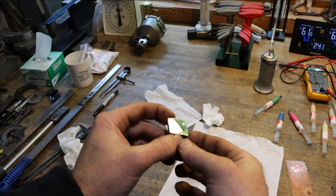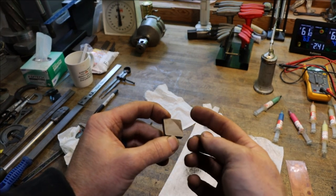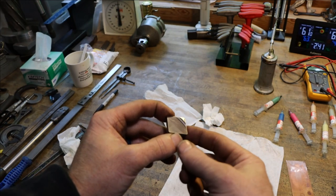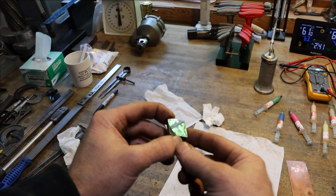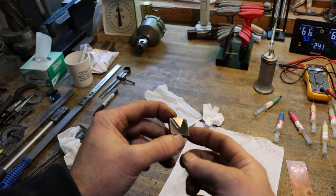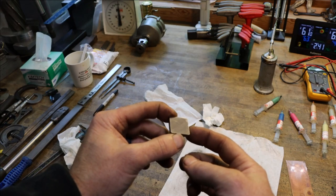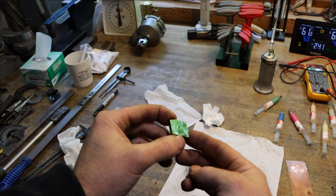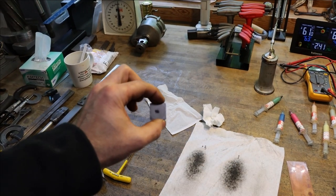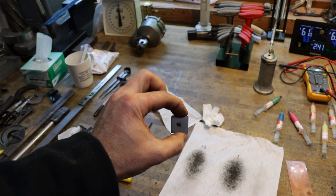That looks pretty good. And you only got to do it once, right? Because every time you sharpen it, it'll run right back, and the cutting edge will be that nice, polished, clean surface. You only got to do right at the cutting edge. But when you do the whole part, you just do it that once and you're done. So there you go. That's how I do it. Use the paper towel in the finishing stages, and it works out really well.